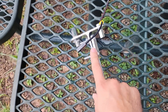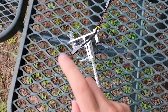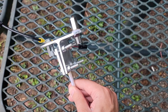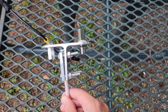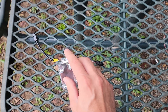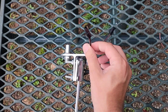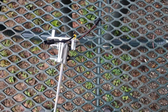This is your everyday standard mirror mount, right? No, it is not. This actually is fairly different than most mirror mounts. What we've got going on here is actually a dipole mount for 3/8-24 mounted antennas, and I'm going to put some hamsticks on it. The first thing we're going to do is connect up some coax, put a 20-meter hamstick on, use my radial set, and do this as a ground spike mounted vertical. Let's get after it.